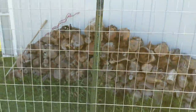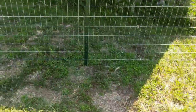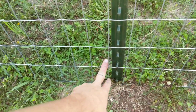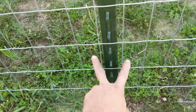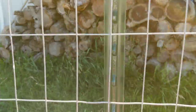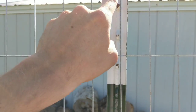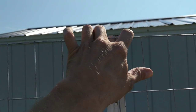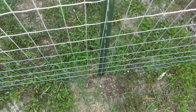I did 10-foot spacing all the way down the line. These are 8-foot T-posts and 8-foot wooden posts, sunk to a depth of 2 feet. As you go along, the fence may be angled — that's okay. Start on the bottom, pull up on the wire to make sure it sits flush. Follow the post with your finger; if the post is way over, grab it and pull it over, even one more section if needed. As you tighten with wire ties, do two at the bottom, then every other one — skip one, do one, skip one, do one — all the way to the top. The last one gets a tie, and if there's enough post, add another tie at the very top. Start from the bottom, work to the top, and manipulate the pole so it stays in line.